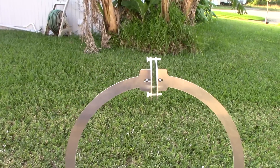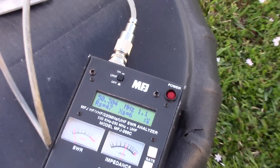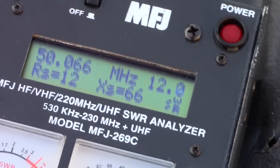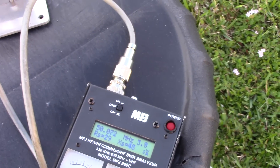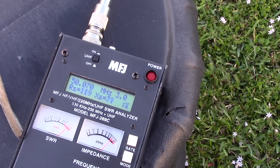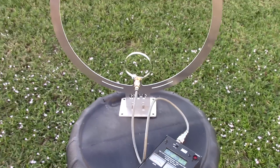You don't even have to tweak all screws evenly. If you get them all even, you can then adjust one at a time by a degree or two. I'm at 1.1 SWR at 50.305. Now going back down to the CW portion — it's at 12.2 SWR, so I slightly bump the screw: 6.5, bump again — 1.8, 1.1. That fast. So with the feeder loop match versus the gamma match, the tuning sensitivity may differ, but basically it tunes that quickly.